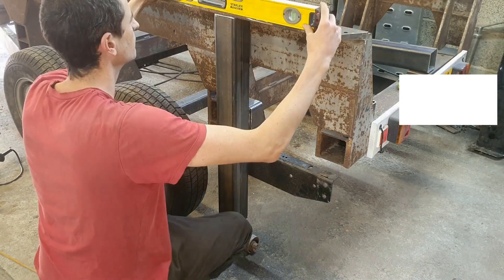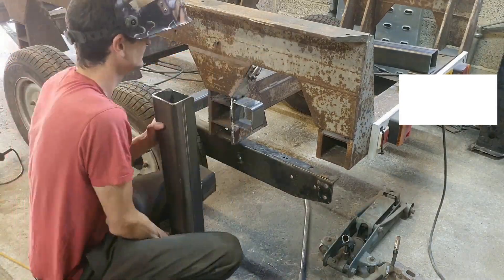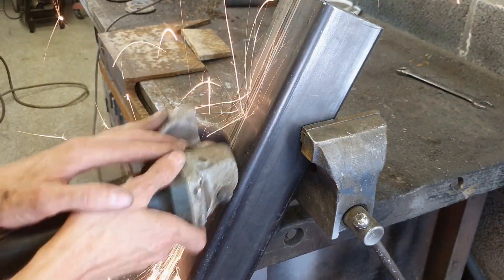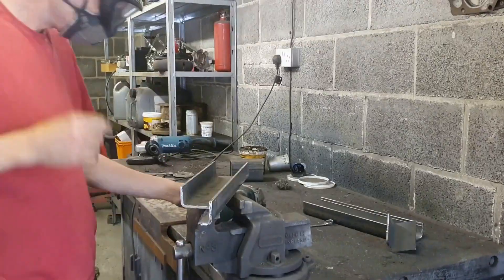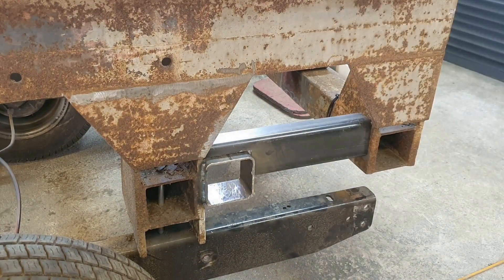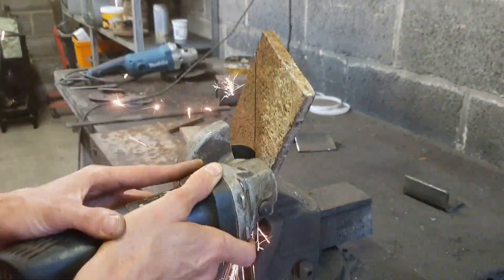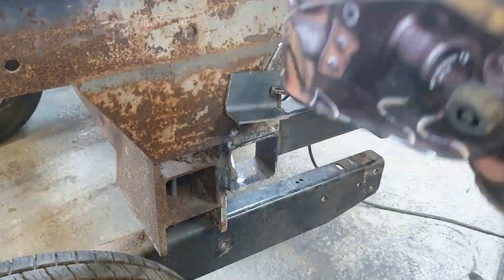I've got the whole rolling road level, then I can get the leg vertical — that's just a nice easy way of making sure it's perpendicular. Get that tacked in place, check it still fits, and then I just went ahead and blasted that thing on there in a permanent fashion. Now I'm making some additional supports to help strengthen that piece. I cut a little section out here and you can see how it fits — I'm trying to support it left-right. That's going to translate the load off to the right-hand side. I've welded those in now and I'm very pleased with the result.